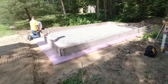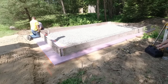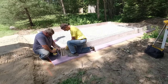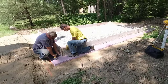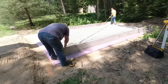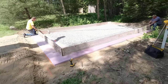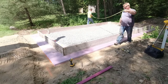If you don't need the styrofoam, you can do this exact same thing without it. We get our boards laid out — the two end boards are 12 feet exactly, and the side boards are longer than the slab length so we can screw the end boards into them. I measure 21 feet on one side, mark it, and screw those corners together. To get the slab square, we measure diagonal to diagonal until both diagonals are exactly the same.